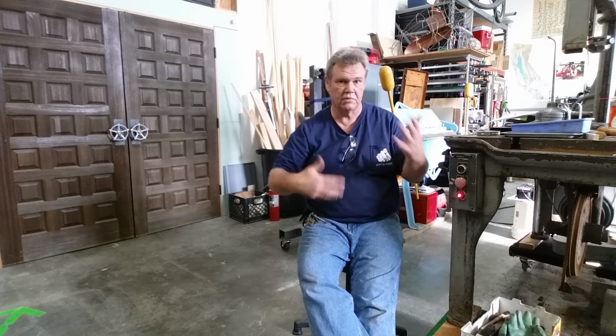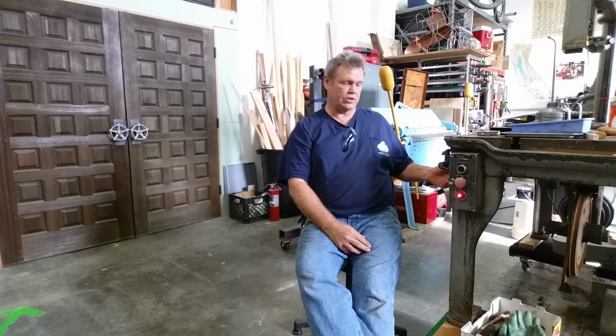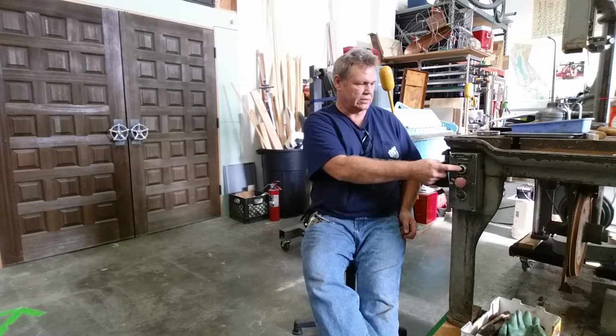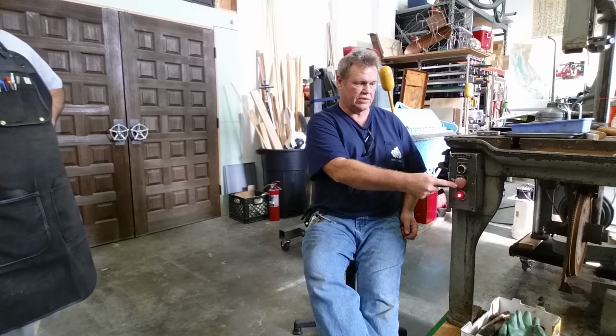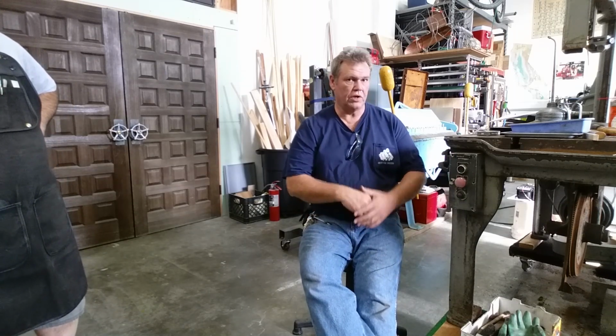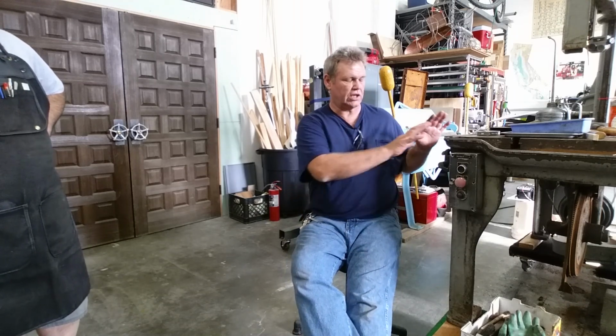And there's our result. We've got a run light. We're running a motor. We've got the gearbox disengaged. We're not spinning any of the mechanism, but we have a motor up and running. And we've got a trip switch, right here on the side, which drops out our run command. And we've got a push button e-stop here. Same thing, drops out our run command. So we know we're functional as far as control goes, and we're ready to mount the sub base in the cabinet and finalize everything. But we wanted to check the machine as well as our work within the panel.